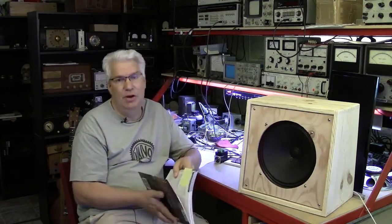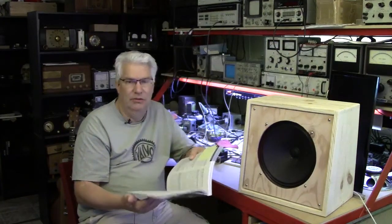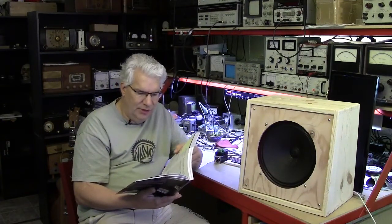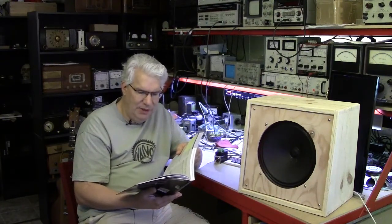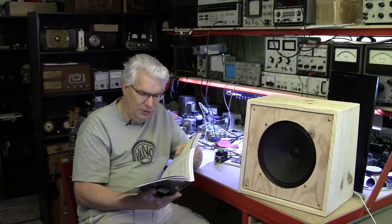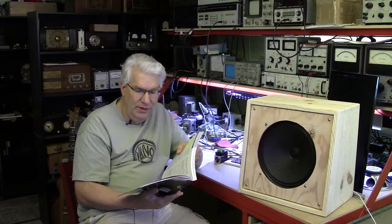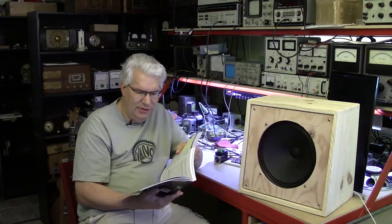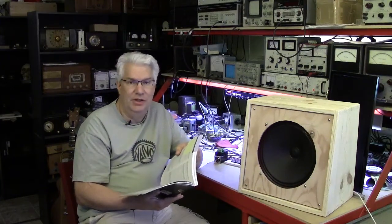So I'm going to read this to you. This is from Mark Sampson of Star Guitars, and he's in the Meet the Maker section in the back where Dave interviews a bunch of amplifier designers. He says, it sounds like you're saying it really comes down to a lot of listening and a lot of testing of variables. And Mark replies, yeah, I have a test bench that I use, although it's packed away right now, where I can mount up to 6 output transformers with one big rotary switch, and then I listen to them back to back. Then there's another knob where I plug in 4 speaker cabinets, so I can listen to 6 different output transformers with 4 different speakers and listen to all the combinations.